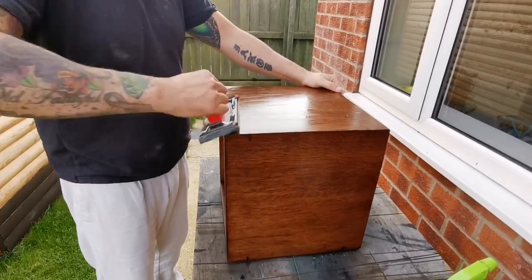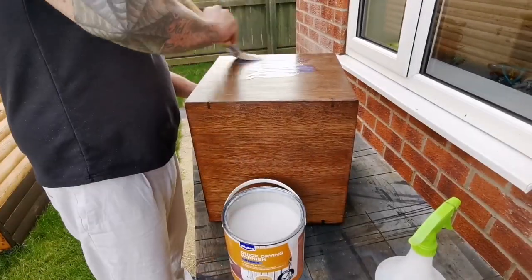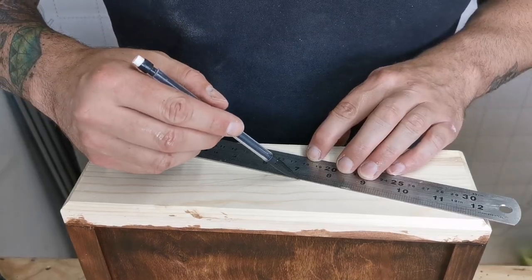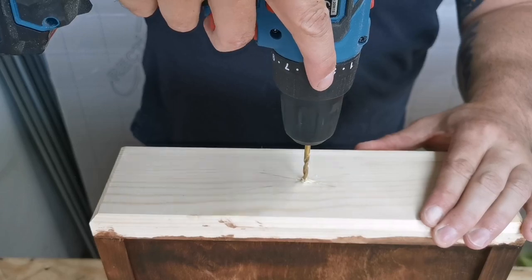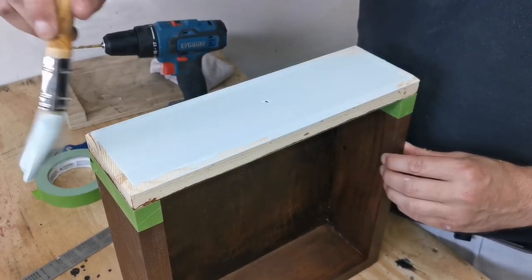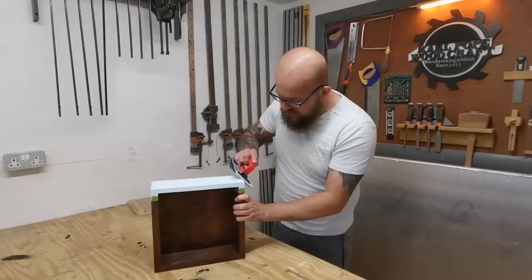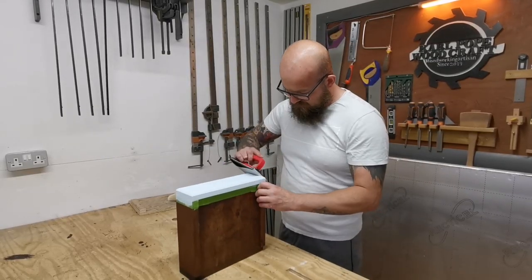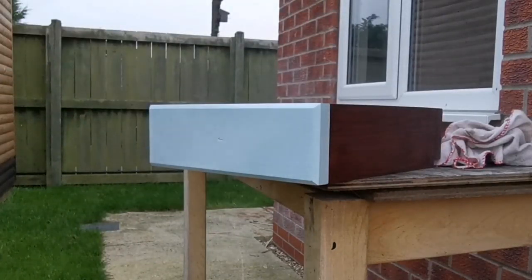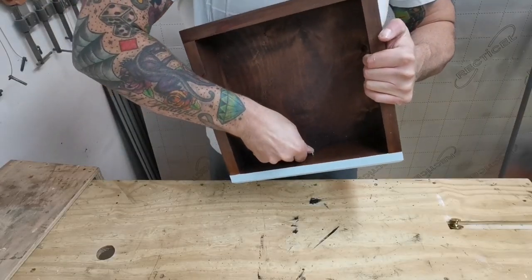The whole piece got four coats of acrylic varnish — this is a quick-drying varnish so you can apply several coats in a day. I denibbed with 400 grit in between coats, then washed down, cleaned, and recoated. Before painting the front of the drawer I marked out the centre and drilled the hole for the handle so I didn't scuff any of the paintwork at the end. I found a little brass handle that I had lying around and I thought I'd use that, then I applied two coats of matte duck egg paint. I used frog tape to seal the edges for nice clean lines, denibbed between coats, and applied the last coat. I then gave a couple of coats of acrylic spray varnish.